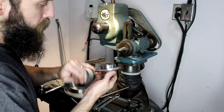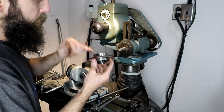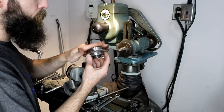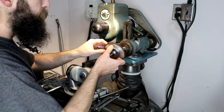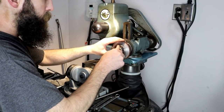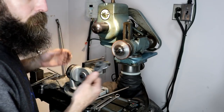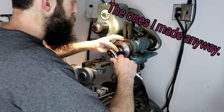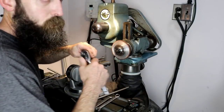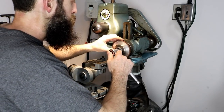I've got a brand new diamond grinding wheel here. This is a 4-inch by 1/8 inch, and a brand new hub and a brand new nut, both of which have never been run before. I know the radial and lateral runout on this hub, but all my hubs are within a few tenths. So we're going to check the runout on this wheel and see how well it runs. It's a Schar's wheel, and I think it's 100 grit. It's a D1A1 wheel.